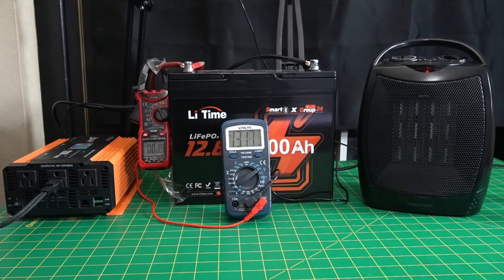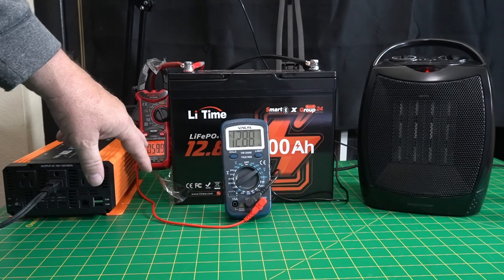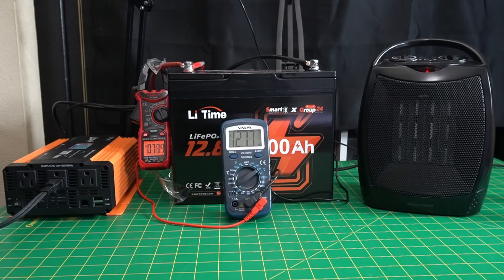We're just going to run the fan for a second. Down to 13.18, 2.9 amps. Let's turn the heater back on to run the battery down a little. We're peaking around 850 watts and it's working its way back down — about 800 watts now, leveling off somewhere around 750 to 800 watts. This is what we had to do to then put the battery in the freezer for the low temp cutoff test.